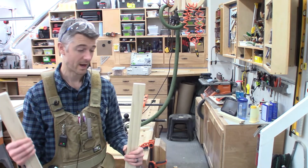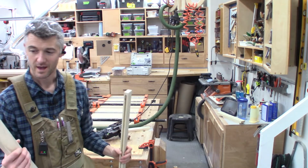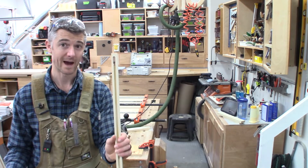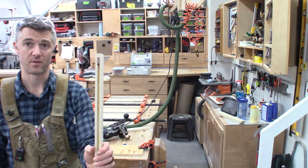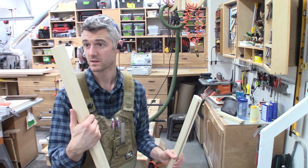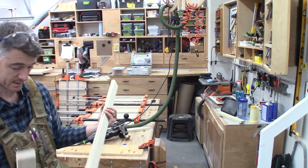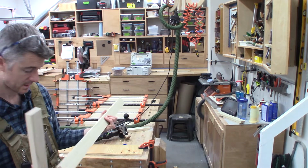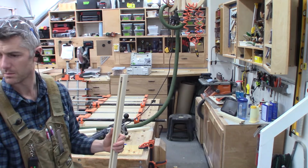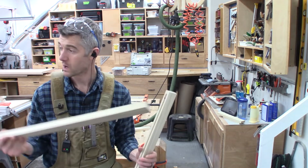And what I'm doing is I recut the groove for the panel, and now I'm using the Domino to mortise out a new mortise. You can see this is kind of a before and after here. It does a clean job of getting all the stuff out of there. So yeah, that's what I'm doing. Unfortunately, it kind of sucks, but luckily I can salvage this, I think, and not have to completely mill up a bunch more poplar that I don't have. So this should work.